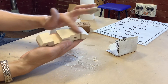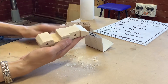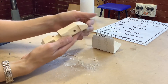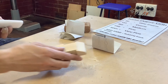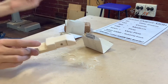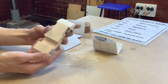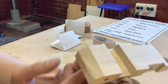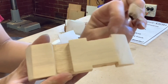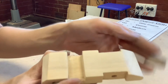Sometimes with your 120 you'll get to a point and think you've done everything, then put your next grade on and it'll start to show up things you hadn't seen before. If that happens, go back with your 120 until you can get rid of those. Once you've done that, the next grades shouldn't take anywhere near as long — your first one takes the longest, and the subsequent ones are just getting rid of the scratches from the previous sandpaper. You can actually see the scratch marks on this side but not on the sanded side — and the feel is incredibly different, an awful lot smoother.